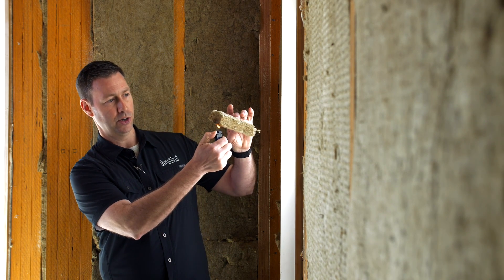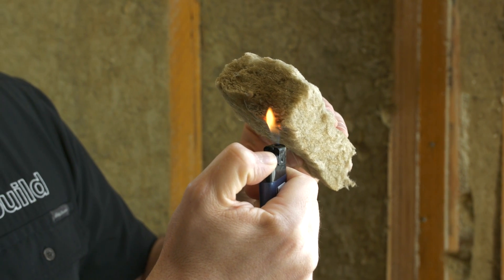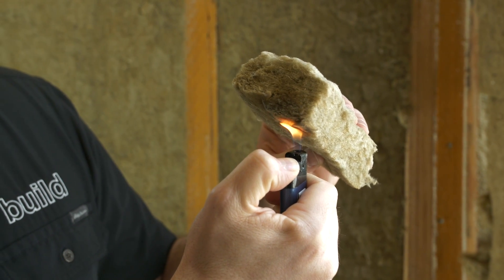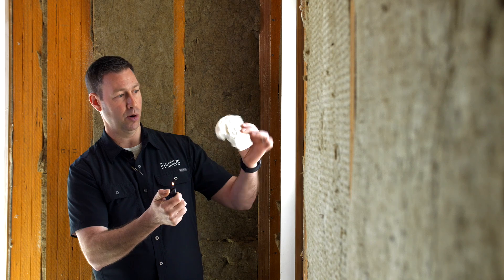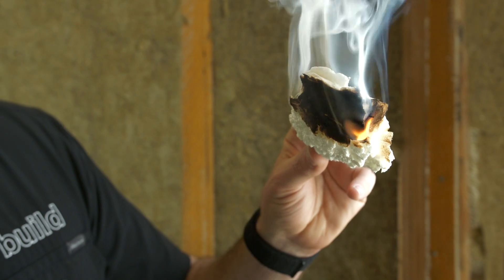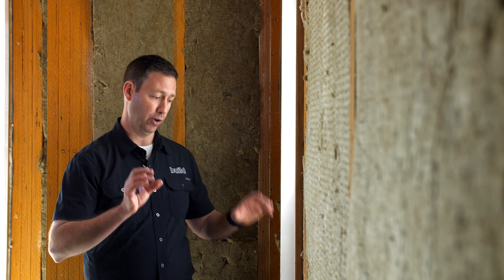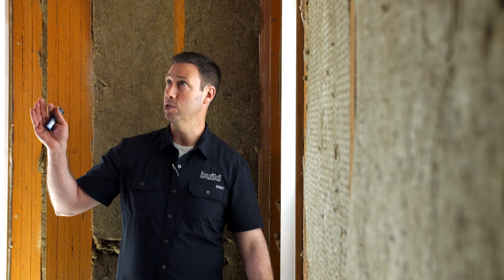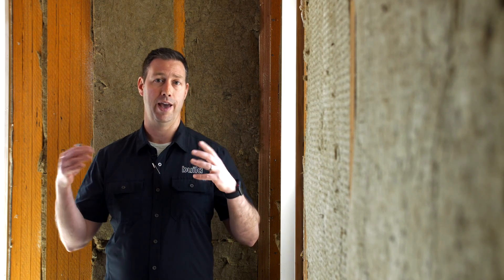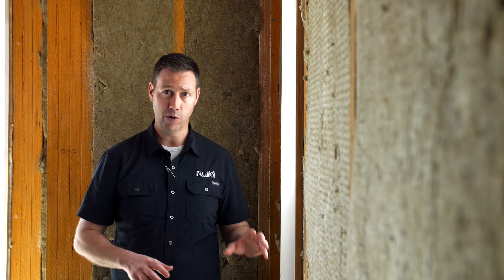With a BIC lighter — check this out — this is our stone wool right here. We can lay that flame on there for a long time and nothing happens: no smoke, no fire, nothing. On the other hand, if we take a piece of the open cell insulation we used in the roof line, look at that — it ignites relatively quickly and smokes up. I have no idea what's in that smoke but it's not good for you. So by covering all of our spray polyurethane foam with a product like this, there's a big fire-resistant benefit to this house. We also have sprinklers and we're going to be spraying an intumescent coating in the attic where we've got exposed foam, but by going with rock wool over top of that insulation we've got a big benefit for fire.